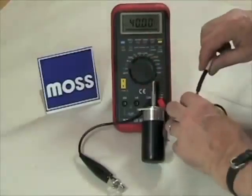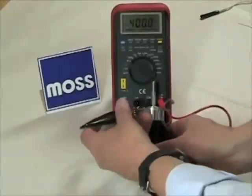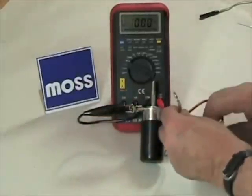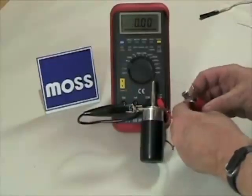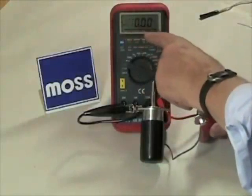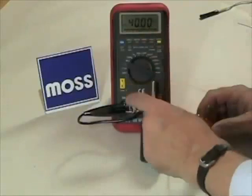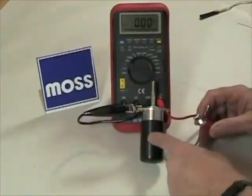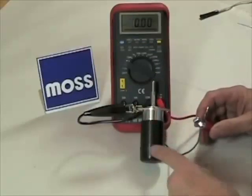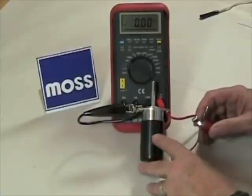What I'm going to do is disconnect the wire that went to the solenoid from the last switch, and I'm going to connect the ground lead from my meter to ground close to where the solenoid is connected to the transmission. If I connect these two together and my meter gives me a reading of infinite resistance — resistance is what fights electricity — if I have infinite resistance, no electricity can get through to ground. That would mean there is a broken wire somewhere in the windings inside here, and the solenoid will not function.